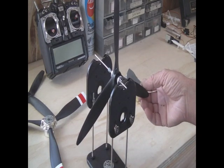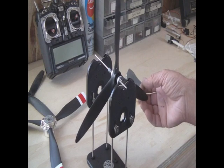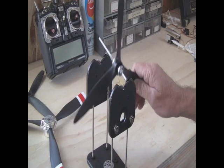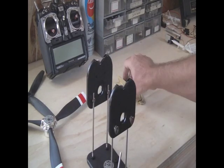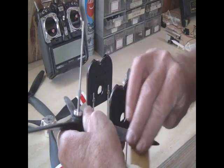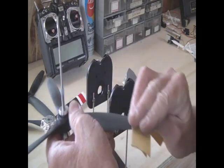You can see it's just a tiny little bit heavy on the number three blade. So we take that off and we sand the face — or scrape, depending on how much needs to be removed. We just do the face, not the back edge, which is the airfoil.